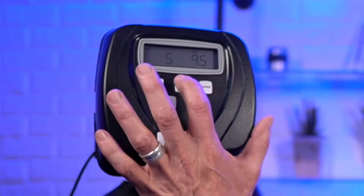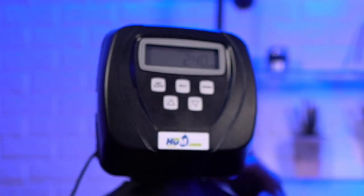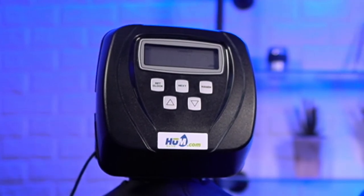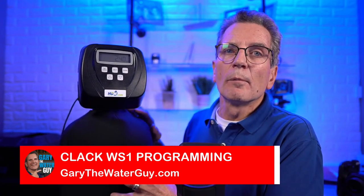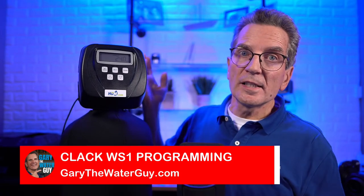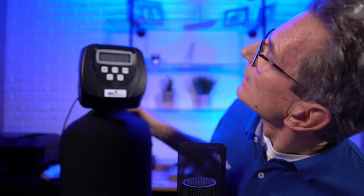All right, let's get back to the Zoom here. There. All right, so we go next. So now we look at the capacity, okay? So again, this is a 30,000 grain water softener. Hey Gary, if this is a 30,000 grain water softener, why is this set to 24,000? It's because you need to set it for 80%. That's where it's the most efficient. Okay, so if you got a 60,000 grain water softener multiplied by 0.8, that's 48,000. That's what you would be setting here. So again, it says 24.0 times 1,000, so 24,000. Okay, so that's how that's set up.